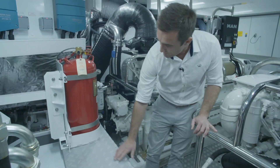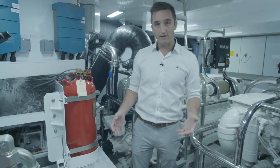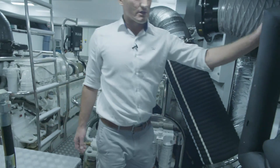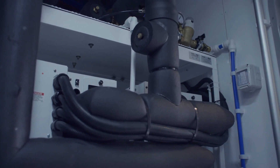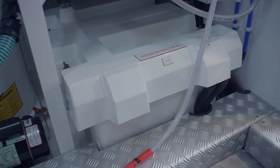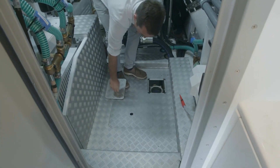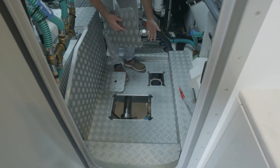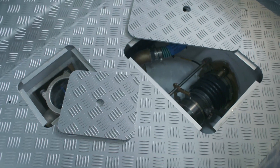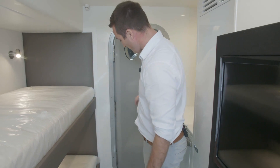There's a little bench across the top of the Sea Keeper, great for placing tools and parts during maintenance. Moving further aft on the starboard side, there's the air conditioning system just outboard of the walkway, and underneath are all the domestic batteries which supply 24V DC throughout the boat for all house systems. Access hatches under the sole are conveniently located over things like the shaft seal, inlet sea cock for the air conditioning raw water, and the air conditioning sea strainer.